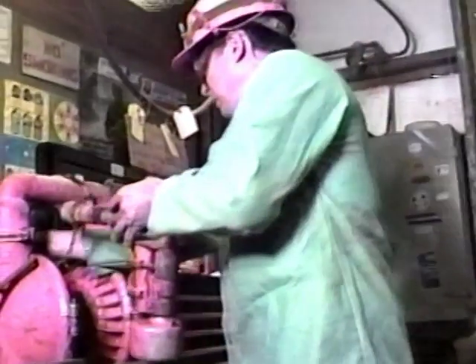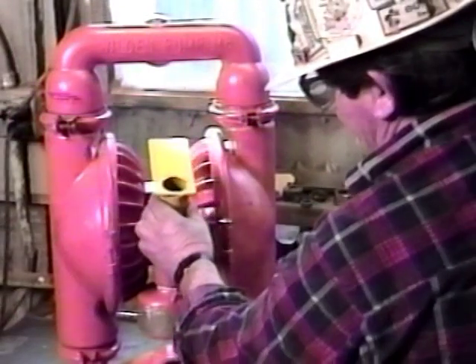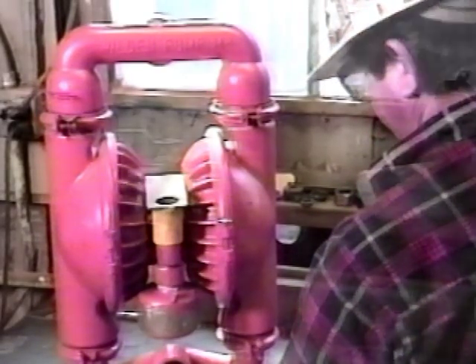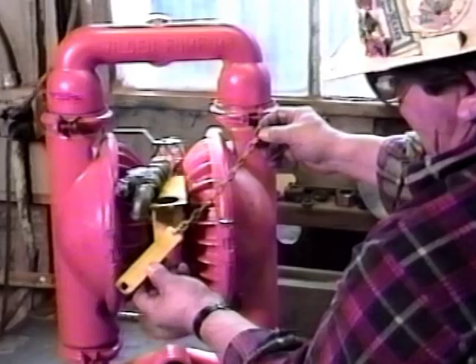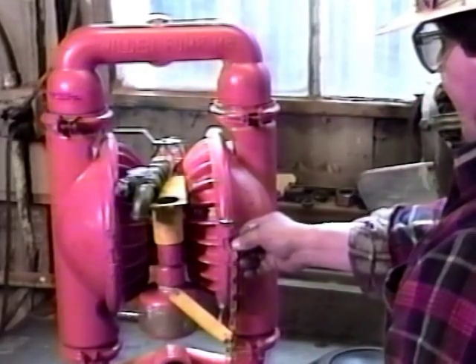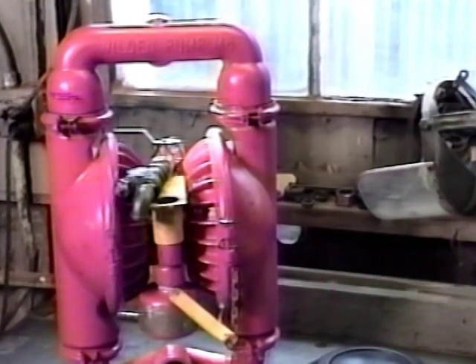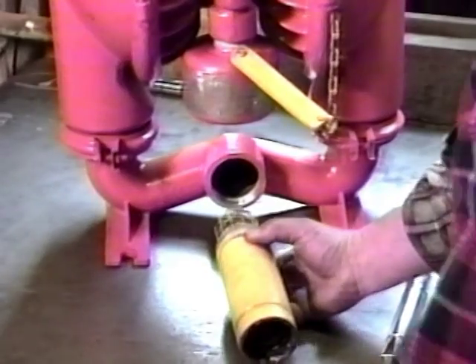The drill shop has applied some in-house modifications to each new pump to improve reliability, performance, and ease of handling. First, a protective cover is fabricated to prevent external damage to the air valve body and piston. Second, a special tool is fabricated and permanently attached to the center section of the pump to allow quick access to the oil reservoir for servicing. A light oil, 10 weight maximum, is recommended for proper lubrication. Third, a stainless steel suction screen is fabricated and inserted into the inlet housing.